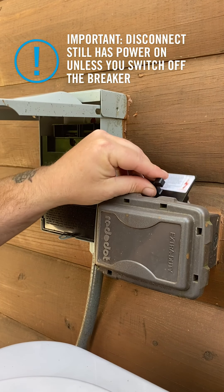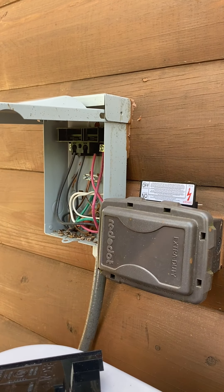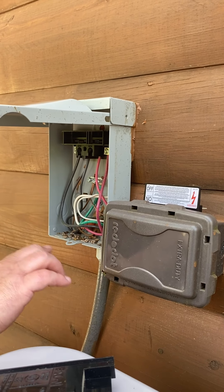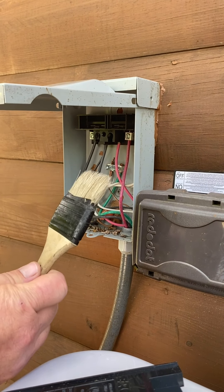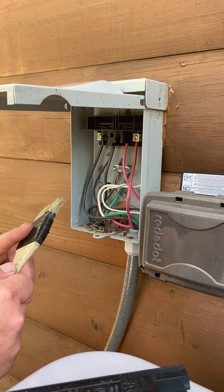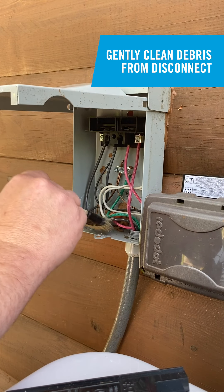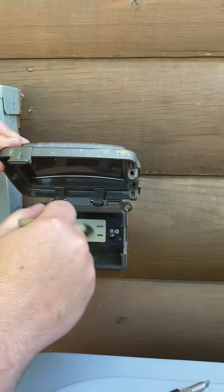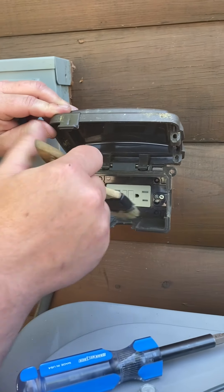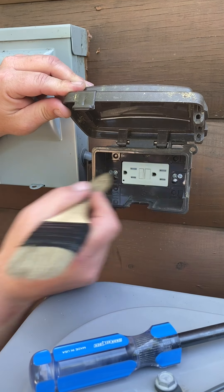Now you know how to turn the power off to your unit. You can remove the disconnect portion — the bottom section usually snaps right out, or it'll have a small screw to remove. This exposes the electrical wiring. Be careful because this disconnect still has power unless you turn it off at the breaker. I noticed some insects in here — I'm going to use a small paintbrush wrapped in electrical tape to prevent conducting electricity, and gently clean the bugs out. If you have a service outlet nearby, open it up and clean it out as well, and test the ground fault receptacle to make sure it's operating.